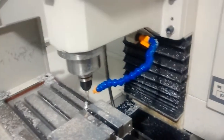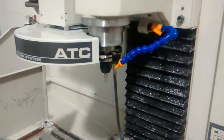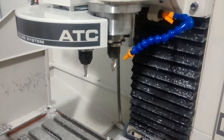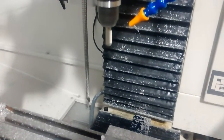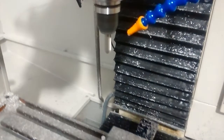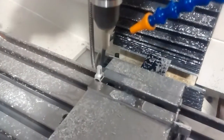Alright, we're ready to switch the tool bit. I'm going to turn the coolant to off. Here we are — put away tool number 10, pick up tool number 9, which is a 7/16 inch ball cutter. Coolant should not turn on this time so that I can get the phone a little closer and you can see what it looks like. A little dripping going on, but that's to be expected.